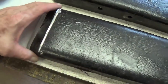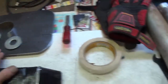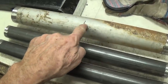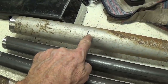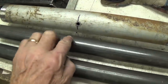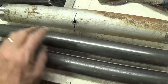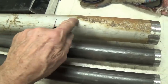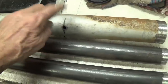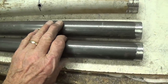Now it's time to start doing some welding, grinding, and fixing up these parts to make them presentable. We've had to have a mid-course correction here — instead of the larger diameter pipe, which is cast iron, I decided to go with a smaller diameter steel tubing. Number one, the smaller diameter actually looks better, and number two, cast iron is real hard to weld. So I'll throw this back into the scrap heap and we're going to go with some nice steel tubes for our legs.